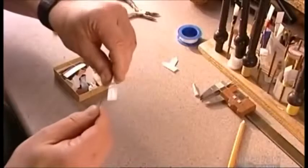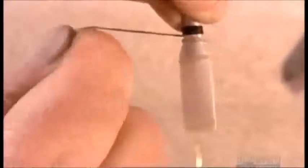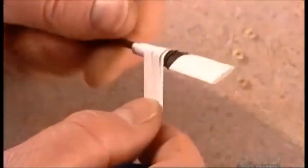A small metal tube between 2 plastic blades forms the chanter reed. When air strikes it, the reed vibrates inside the chanter, a pipe at the bottom of the instrument that has 8 finger holes for notes and 2 for pitch adjustment. To secure it, the craftsman wraps the reed with hemp string and winds Teflon tape over the string for an airtight seal.